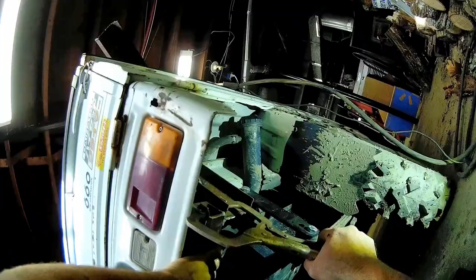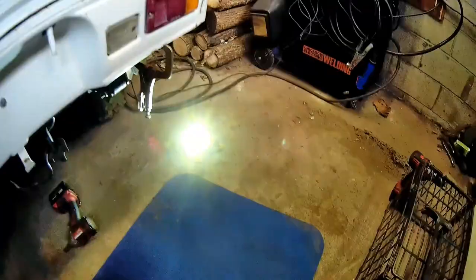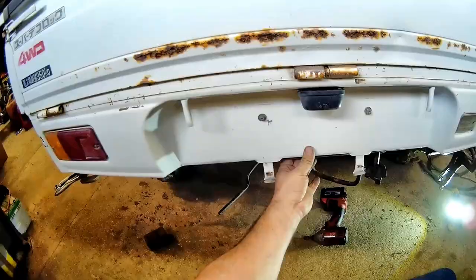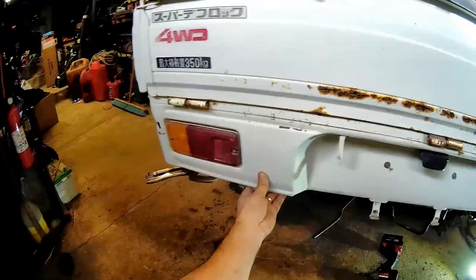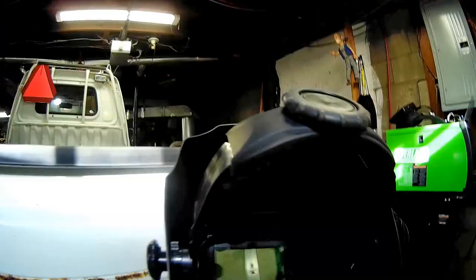Flat across the back here, equally. Looks pretty damn close. I don't know - tack her up, I guess. That should work. Tack her up, take it down, and weld it up. You could actually bolt right through this too and hold all this everything together in one big shot. I'll switch that over to weld.